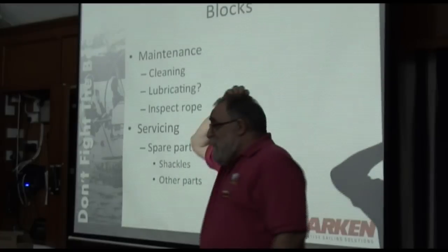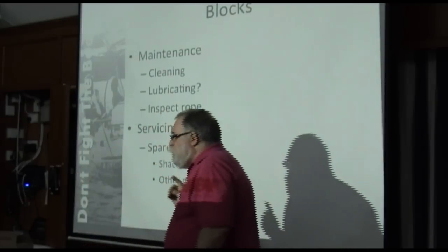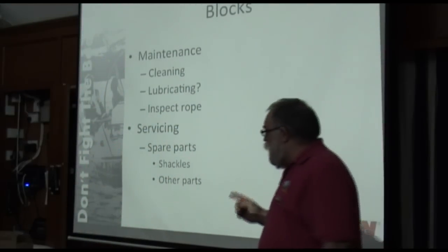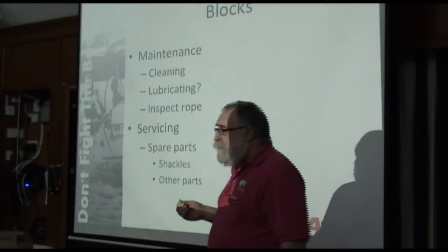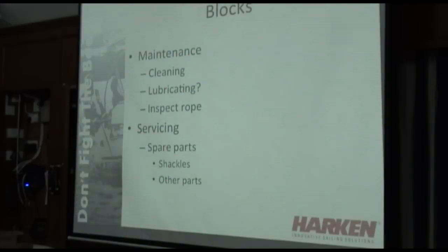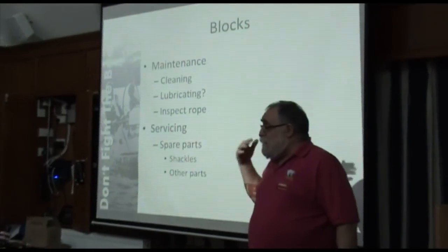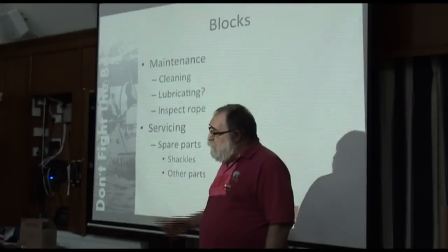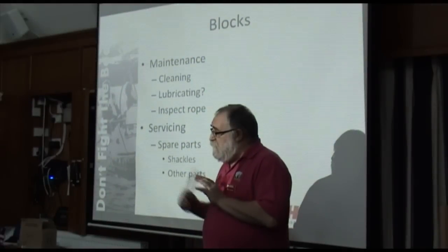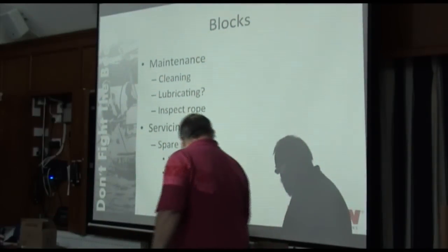You mentioned lubricant. That's a very good question. In general, no. Because what happens is you over lubricate because you can't control yourself. And when you over lubricate, everything starts skidding rather than rolling, and that starts flat spotting and it's worn out. I'll talk more about balls and the only lubricant you should use when we come to tracks.